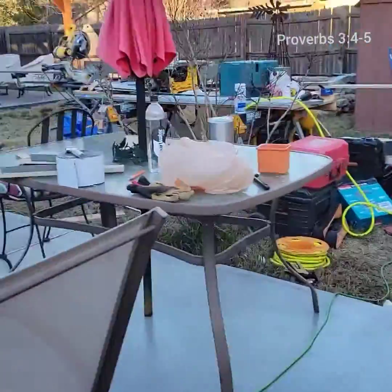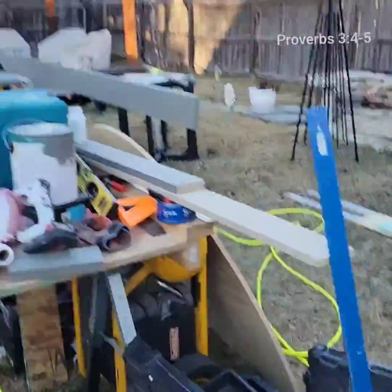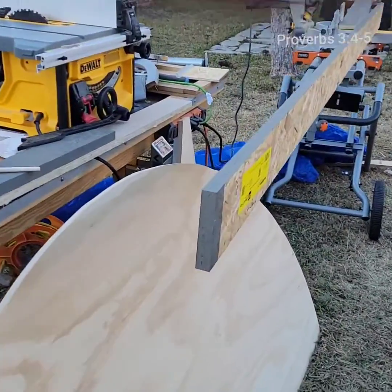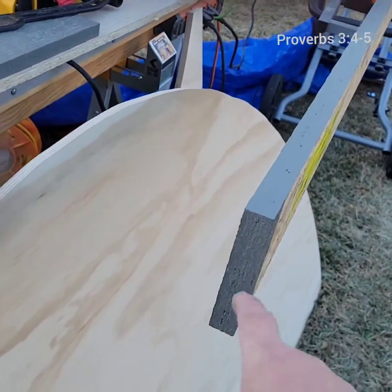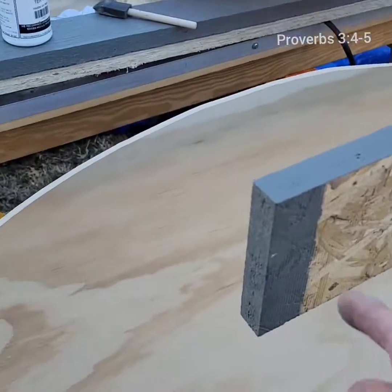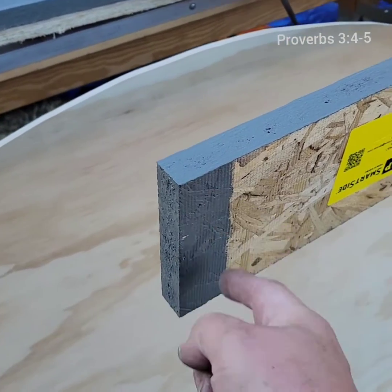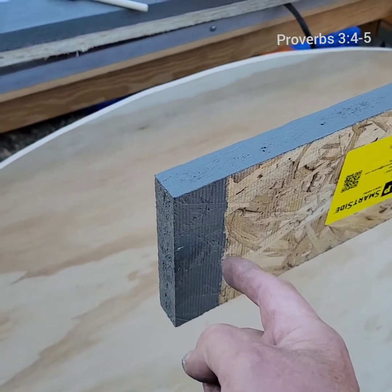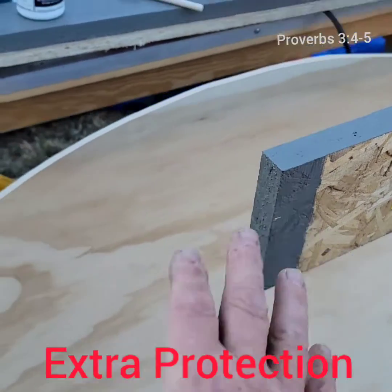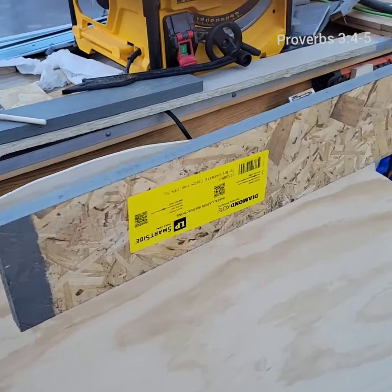What we do when we do our cuts here — on the special pre-finished and even on the primer — we use primer instead of paint. All of our field cuts, we paint all of our factory cuts and all of our field cuts before we install. On that piece right there, the bottom facing the house, this area is going to be exposed a little bit below that flashing, so we put a coat of paint on there as well to help protect it — so we don't get any water or swelling back up behind that trim, because this stuff is expensive.